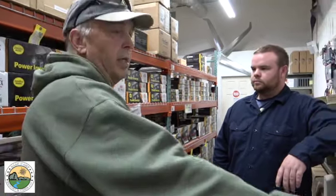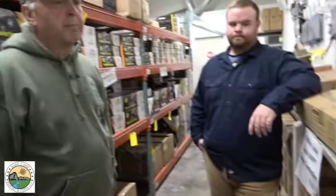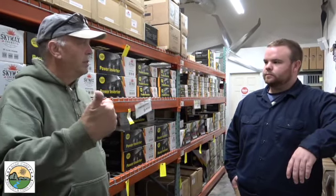For something that size, what would we be looking at for the number of batteries and panels? You also need a charge controller and an inverter. In that case I'd go with a 24-volt system — actually 48 volts. How many panels would that take? About six panels, and then four batteries of the 170 amp-hour ones.